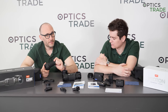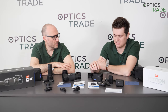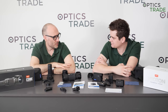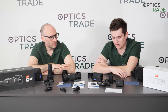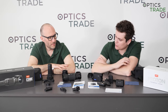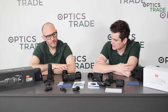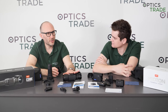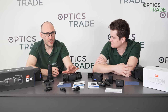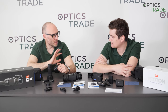Another big plus is the color modes. We have eight color modes on the Proton — of course the most popular white hot and black hot, and then red hot, red monochrome, and sepia. Red monochrome is really good for your eye in the middle of the night. It all depends on what kind of situation you find yourself in, and then you pick the mode that suits the scenario best. With the Core, you simply had two modes — black hot and white hot — and by pressing one button you switched between those. The Core went through three generations: the first had 25 micron pixel pitch with a green image, the second had 17 micron pixel pitch also in green, and the third generation — the current one — is black and white.